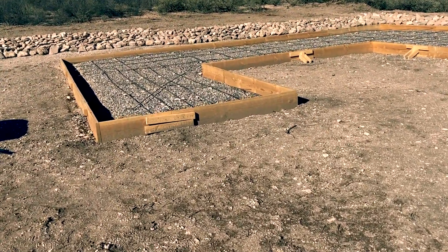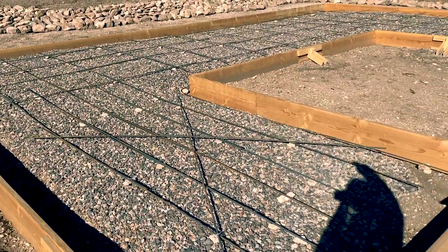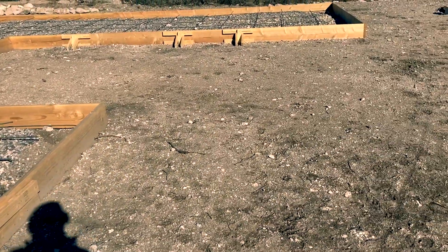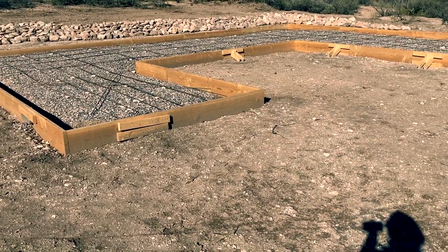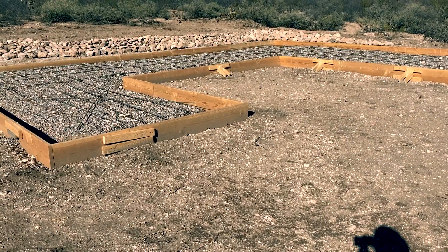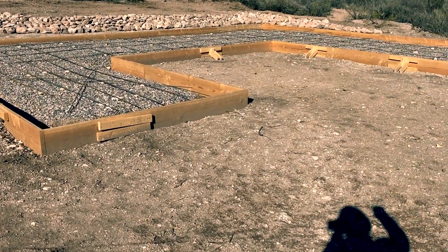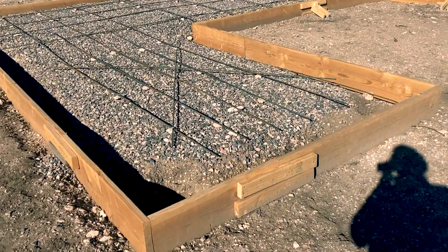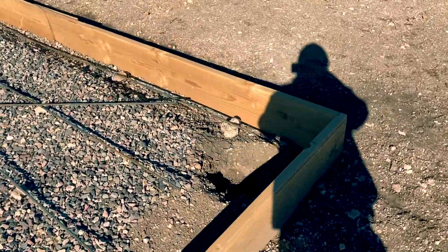Normally for this type of foundation you would dig a pretty deep trench all the way around the perimeter, usually at least a foot deep and a foot wide, though that can change depending on your climate. If you're in a really cold climate you're going to have to go below your frost line, which could be a lot deeper than a foot. If you're on soft ground or building a really heavy building you'll want to go deeper. For me I'm in a mostly warm climate on really hard ground, so it wasn't necessary to make such a deep footing. What I did instead was keep it pretty much right on grade and then made footing holes in the corners. Every corner has one of these large holes — think of them like soccer cleats — that's going to help the building grab into the ground so it doesn't shift around over time.